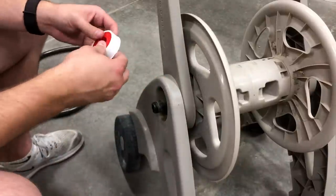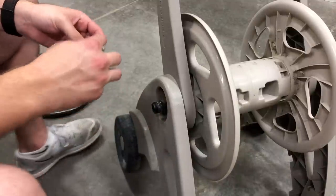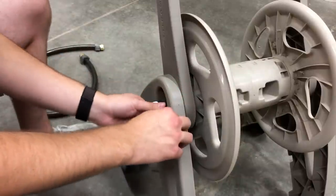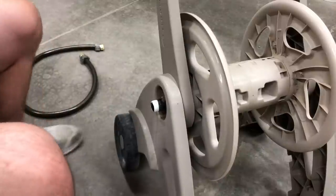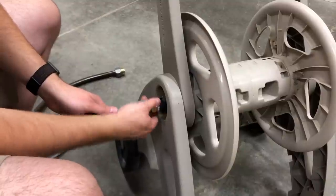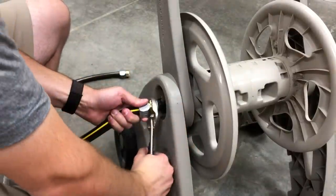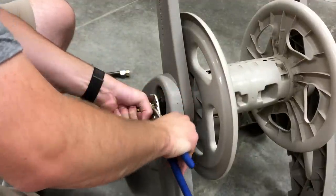Before we connect this, I want to put a little bit of plumber's tape just around this plastic male piece here, just to give it a little extra seal and make sure it will fit on there nice. Just wrap it around a few times — that should be good. Let me go ahead and attach this end here and get a nice snug connection to prevent any leaks. It's a little slick to the touch, so we'll just shore it up a little bit here with our pliers.